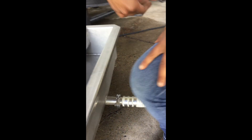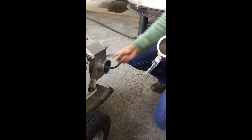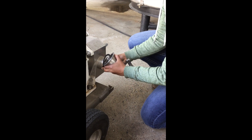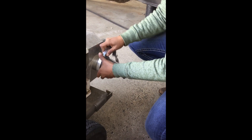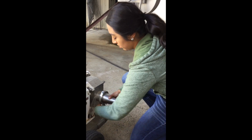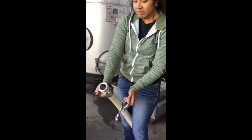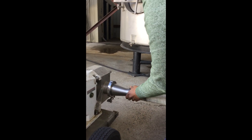Make sure it's tight so you don't lose any product. That's what it should look like so far. Now take a three-inch gasket and clamp and attach your reducer to the inlet part of the pump. Then get the other end of your two-inch hose that's already attached to the metal bin and connect it to your reducer using a two-inch gasket and clamp.